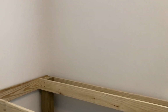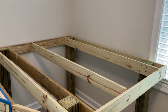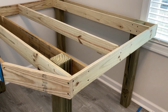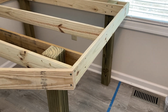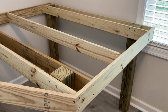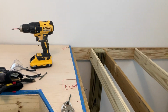So those are a few tips we call problems in production, things that you can either deal with if they show up, or you can plan in from the day before, as you're in the planning stage. You're in the concept and design phase of how you want to build it. And let's say you want to add a chunk on or take a piece off later because you decide you need room to put a sunfish sailboat in here and you need a foot gone off of that. You come in, remove screws, cut pieces, put the little sideboard back on, and it just takes minutes instead of hours. So that's where we're at on this stage. That does it.